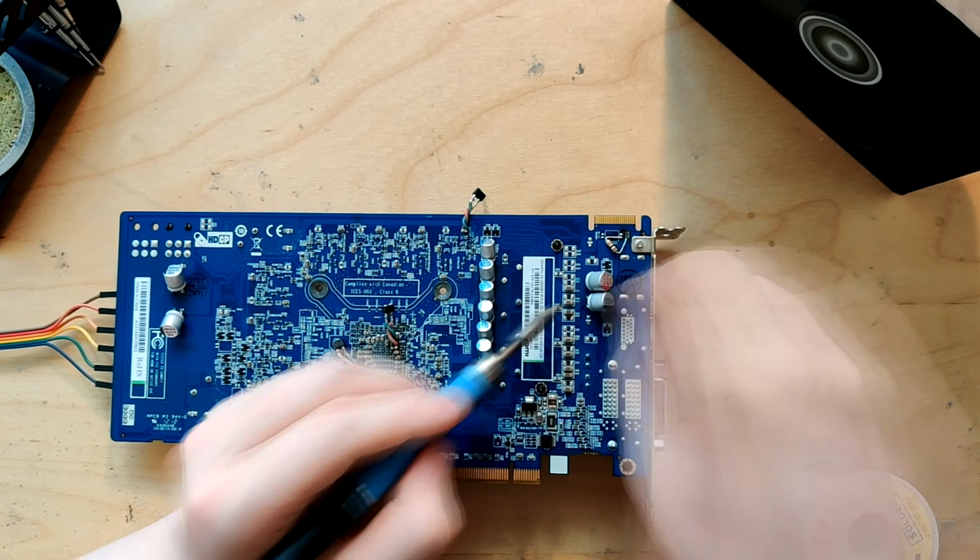Now, memory and VDDCI did not improve in undershoot, at least not at the kind of resolution that my oscilloscope operates at. It has a 10 millivolt resolution, so changes in the undershoot smaller than 5 millivolts, because 5 millivolts is where it rounds up to 10, it does not detect, and as far as the oscilloscope is concerned, the minimums on memory and VDDCI are the same. However, VPP also came down from 115 on memory down to 95.2, I think, or 97.2. And VPP on VDDCI went down from 30 to 23.7 or something like that. So it got better. Not that it does much.